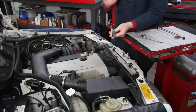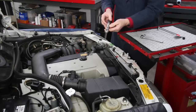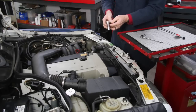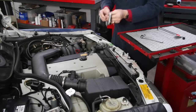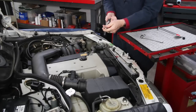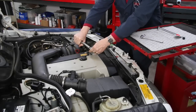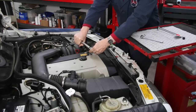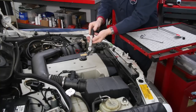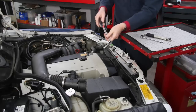The second tool is the click-stop torque wrench. Whether you use click-stop or the beam style, you want a small one — a quarter-inch drive that goes up to around 24 Newton meters. A large torque wrench is generally not accurate at low settings. With a click-stop wrench set at 10 Newton meters, you're tightening down and you're not sure where you are — are you at six, are you at eight? You don't have great feel. They can be accurate, but they also go out of calibration, and unless you have a way to calibrate them you don't know if this one is accurate.